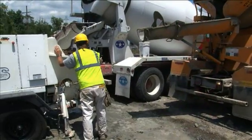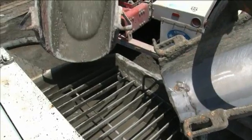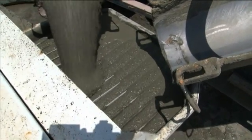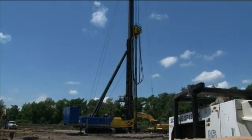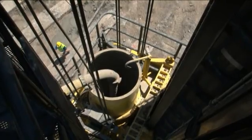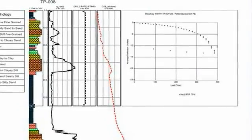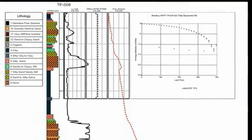Due to the densification features of the pile system, the consumption of concrete in the pile is normally only slightly higher than the theoretical volume except in very weak soil profiles. During pile construction, the concrete pressure is automatically kept at the required level, so strong fluctuations in concrete pressure cannot occur. It is typical for the concrete to have a strength of 4,000 PSI. However, higher strength concrete mixes can be used if needed. Mixes of up to 8,000 PSI have been used for special purposes. A third-party testing lab is always hired to perform sampling and testing of ready-mix concrete used in DeWall piles on a daily basis.